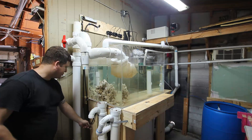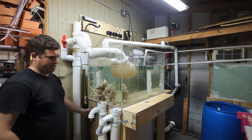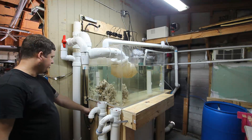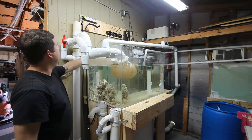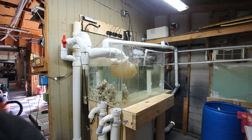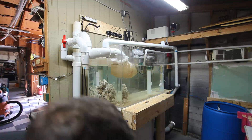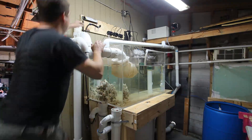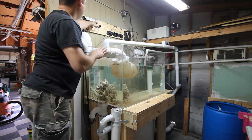The SJO cable has a drip loop. I'm using standoffs — which you can't really see in the video — to hold these down. The SJO cable goes up, there's another drip loop, and up here there's another drip loop that goes into the ballast.